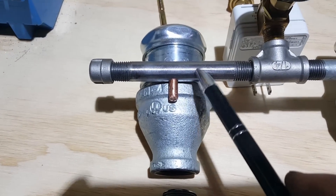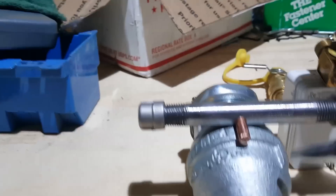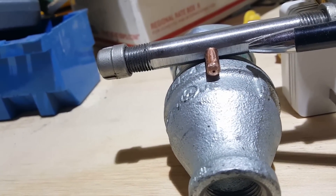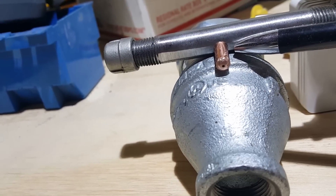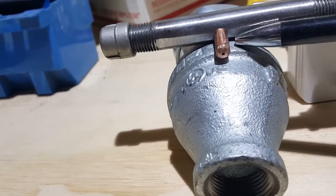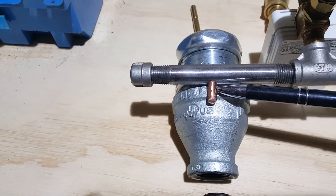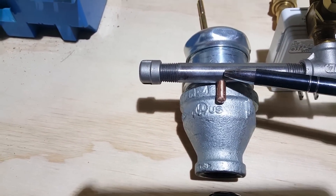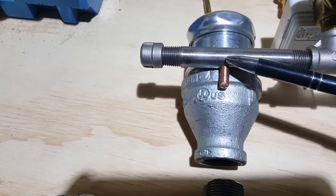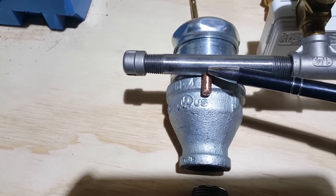Same thing on the left side. The only difference is I took this to my belt grinder and smoothed it down. On the edge there I ground just the slightest bit of a flat so I could get a nice center punch on there and put my MIG tip in. These are Miller MIG tip 030 — on a Miller it's a quarter-inch 28 tap, so I just drilled and tapped there, then shortened down the length of the thread so I just barely go beyond the wall of the pipe nipple.